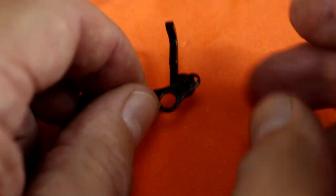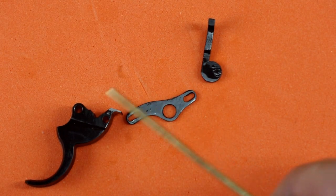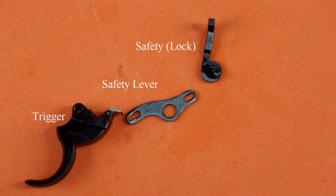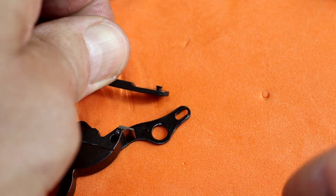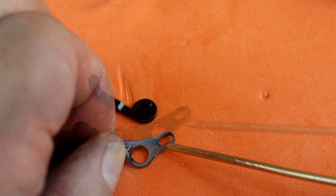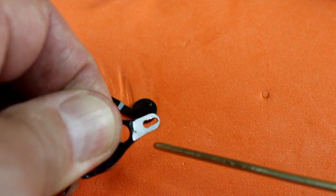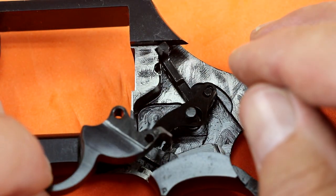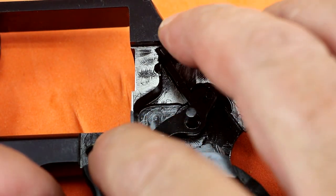Let's have a look at the trigger and safety linkage. We've got the trigger, the safety lever, and the safety lock — sometimes just called the safety, depending on which book you pick up. The pins that connect them are mushroom shaped with a slightly larger head, and the slots are all a keyhole shape, so it's a little bit tricky to get it back together. But this does facilitate easier installation, holding it all together as one piece so I can drop it in at one time.